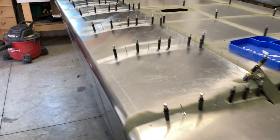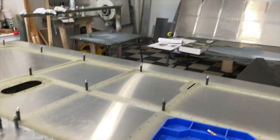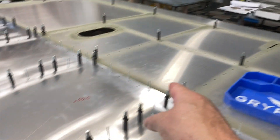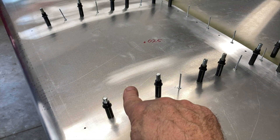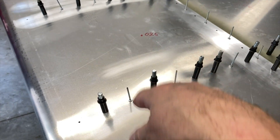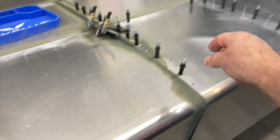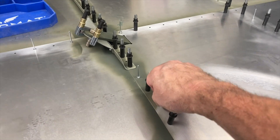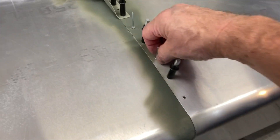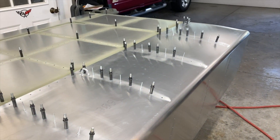I've got something to share. A lot of guys online, when a rivet won't go in, just drill it real quick and then put it in. Try dropping your rivets in first and then come back and cleco it all up - it pulls a little tension on it, you can't get it out, but it's down all the way where it's supposed to be, and it'll rivet up really nice. It worked great - hope it helps!